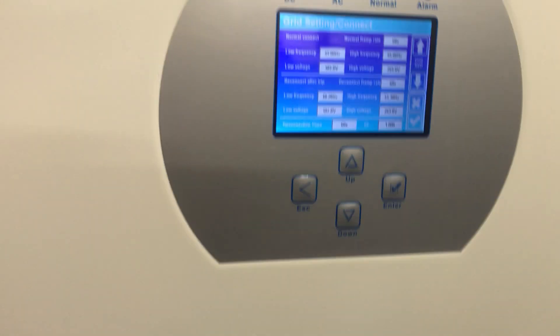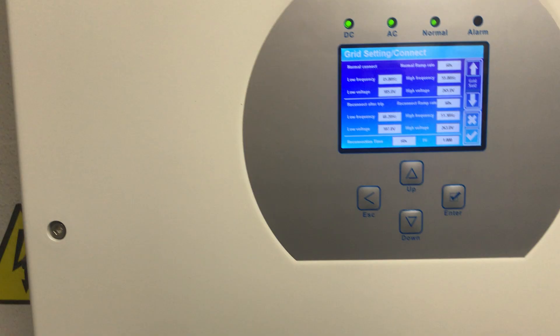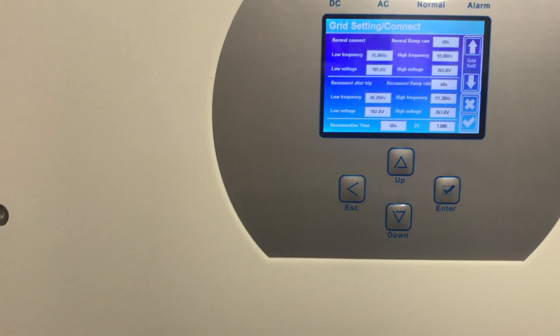That generator is a pull-start petrol generator — it's not particularly stable but it does work. I initially started on the generator input but it didn't pick it up; maybe I just didn't wait long enough. I moved it to the grid input and now at least I can see what's happening and I can set it a bit finer. The grid input for the generator seems to work.